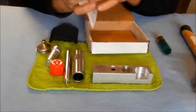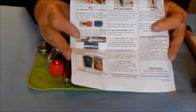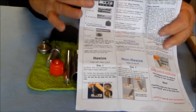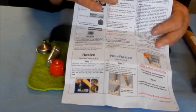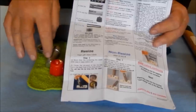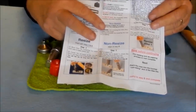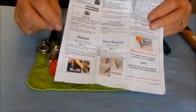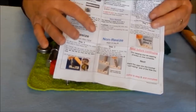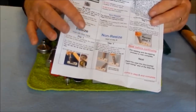Instruction sheet — this is a full color instruction sheet with step-by-step instructions for loading either by the non-resizing method or by the resizing method. Safety tips include: do not work on live ammunition ever, wear eye protection for shooting or reloading, do not use a metal hammer on these components — use a rawhide mallet, about 12 ounces. Also, weigh each individual powder charge. Don't use one of those little scooper kits. Use a reloading manual or the powder manufacturer's website data, and measure each one.